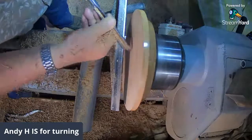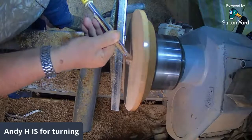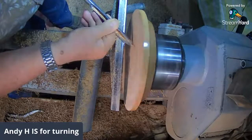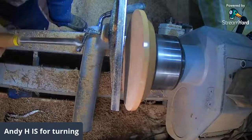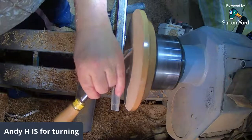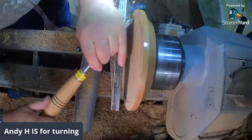Eric Winkler is saying, can you get a good finish with lacquer if you brush it on? If you really work at it, yeah. It's not easy. No. The problem with lacquer is it's cellulose based, so it will dry, and to brush anything you really need a wet edge so that you don't overload it, otherwise you're going to get two or three coats in one place and one coat in others. It's the problem I've just had on the back of this actually. It dries too quickly, especially if it's a bit stodgy to start with and the weather's hot. The answer is to thin it really thin. I put lots and lots of thin coats on. That way you can get away with it.